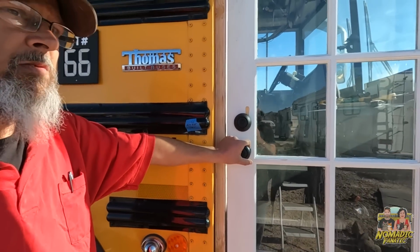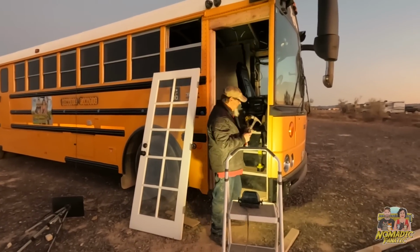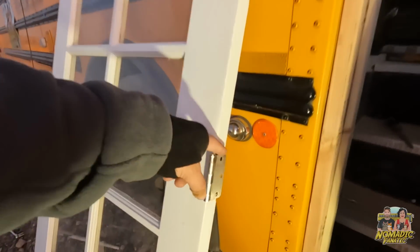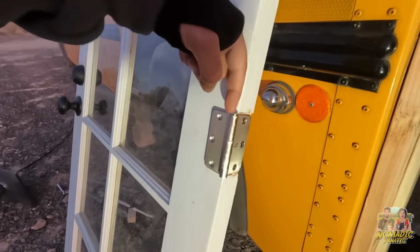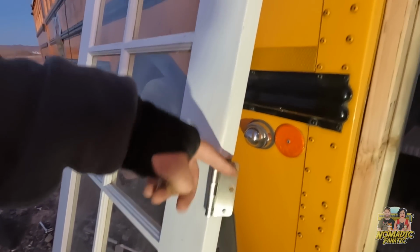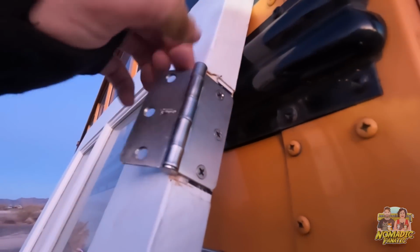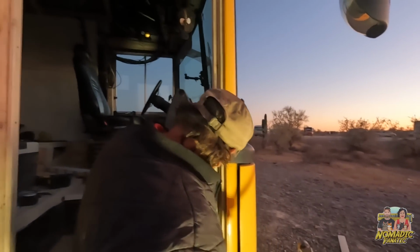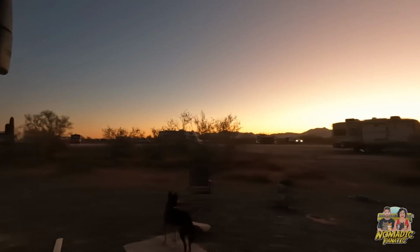And it's gonna come over a little bit after we get the hinge installed, but well, we already lost the sun for today. Today just flew by, and I just had to go to the big markup again to get different hinges. Those 3-inch hinges, they were gonna work this way, but they were way too wide, and it put the pin way out here to the side. So I got these, I think these are 2.5 inch, a little bit of gap up there, but this will all be hidden. So now Wayne's working on notching out the plywood on the receiving end, and I think we're gonna get this hung. Well, it might be dark by then.